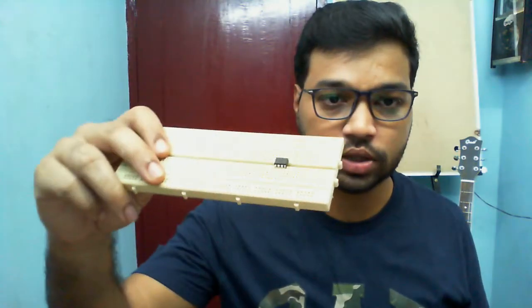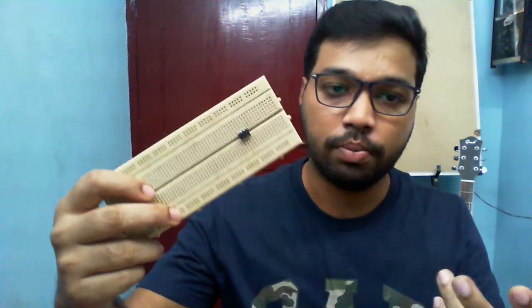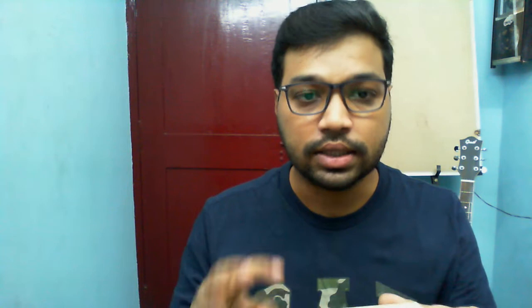It's made up of 8 pins and it can fit into any project — wearable, robotic, automation, or power projects. This is one of the SOIC packages here, and this is a PDIP package. You can just plug it into a breadboard and you still have a lot of room around to work with. That is why the ATtiny85 is extremely special, and it still has all the features supported by modern microcontrollers.